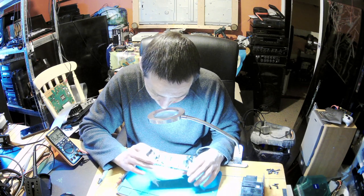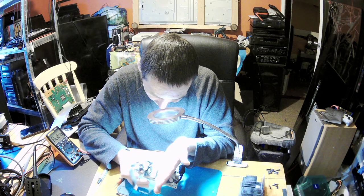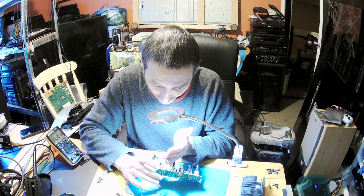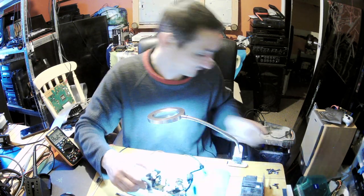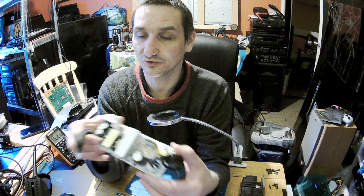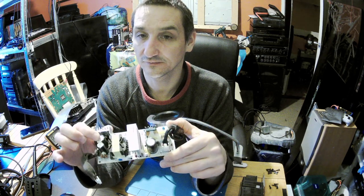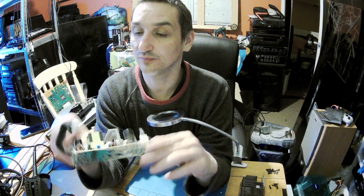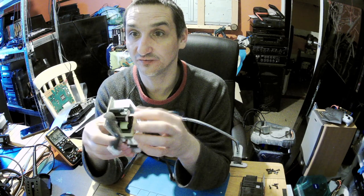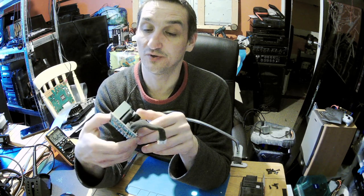Now, I would still remove, because that's all working till here, and then it's not working from here. So we're talking only one choke here. Sorry, I know you don't see anything and I'm trying to explain. Okay, so we're talking only on this side. So we're talking this choke, two caps here, and some probably MOSFET. So the highest probability, if this transformer is still okay, would be that this transistor, the MOSFET, is burned, I would say.